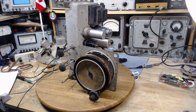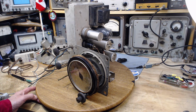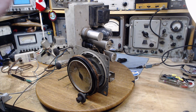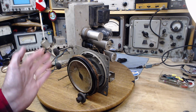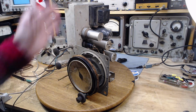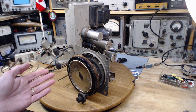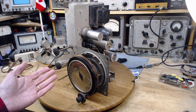And what about this radio? Yesterday I was doing the preliminary alignment of the RF circuits, the antenna circuits if you like. And right at the end, I was finding strong indications that the IF was not tuned properly. The way I got to this conclusion was feeding in a signal from the signal generator at frequencies around the IF frequency, and finding a number of frequencies where the signal comes through the radio. I'm only expecting one at 470, but there seemed to be 4 or 5 spots all the way down to 400 kilohertz.